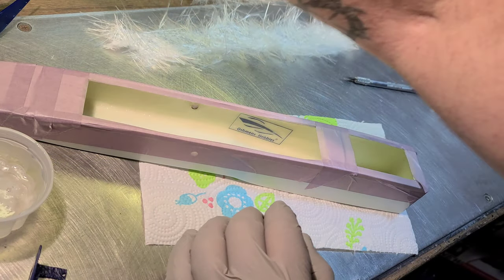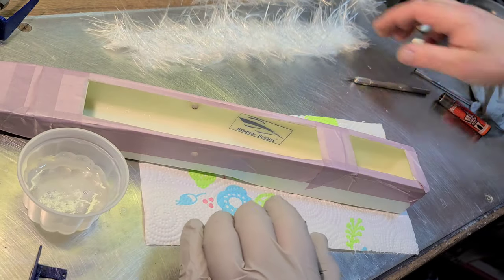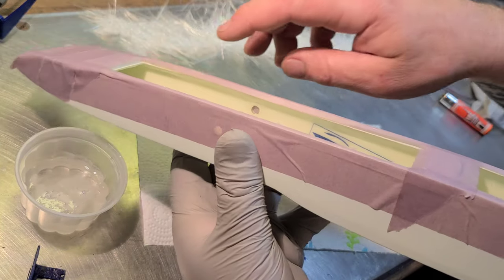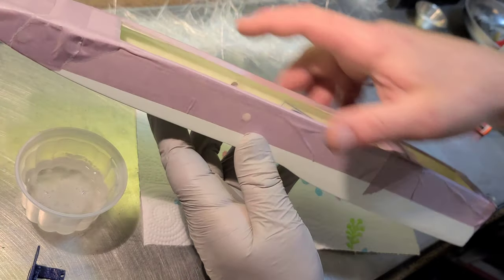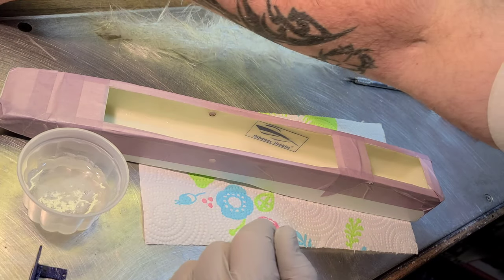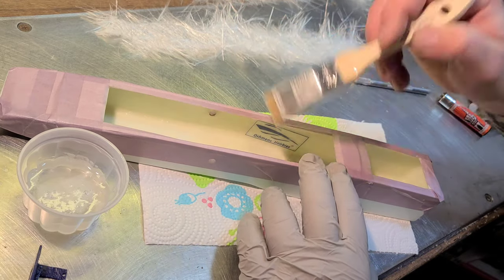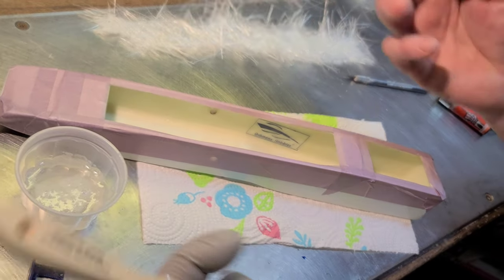So we're going to use some epoxy. I've already got it weighed out. And we're going to reinforce it with this chop strand mat. I also want to epoxy in around these outrigger boom tube holes, reinforce that, and give it some structure. So we're going to get started on it. I was thinking about using this old chip brush. Probably going to use both of them.